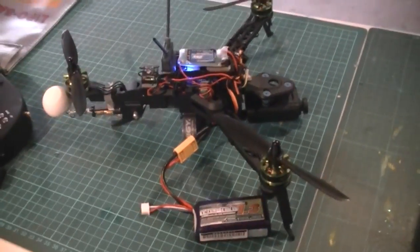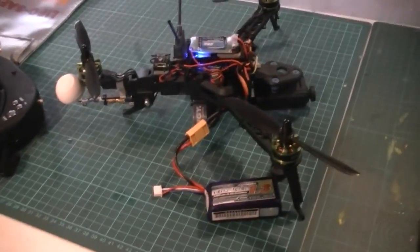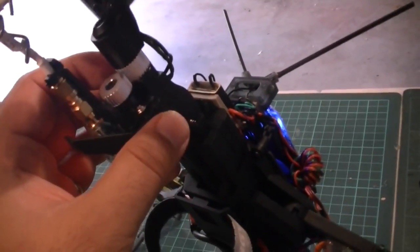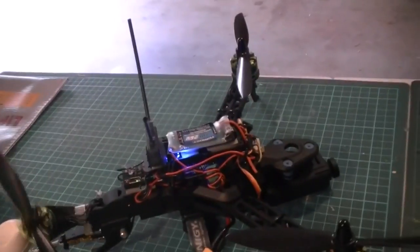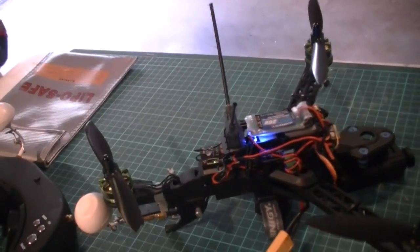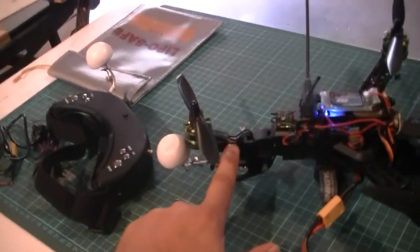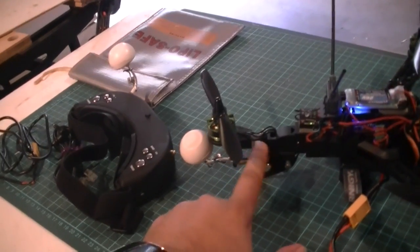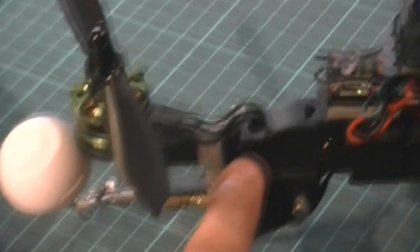It's a pretty cool device — I really like the design and it went together quite easily. A couple of issues to touch on if you're building this: the rear gears have a shaft that runs through, and some people have reported that it was really rough and didn't move easily. Even though mine didn't have that binding issue initially, it did eventually bind up. What I did to fix that was put a little bit of grease on the shaft — so always do that when putting the gear section together, make sure there's lots of grease on the shaft, and you'll have a nice smooth rotation.